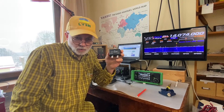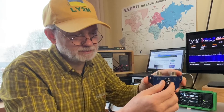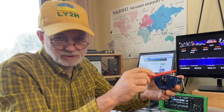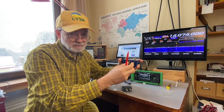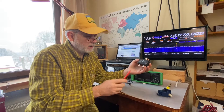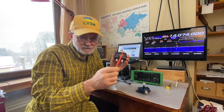So now, if it were a diplexer, it would actually work a lot like a simple antenna switch — like this good old mechanical antenna switch. Antenna A, antenna B, and the common transceiver here. You can connect an HF antenna on A, a VHF/UHF antenna on B, and you switch manually each time you change bands. But it's just a matter of time before you misbehave and transmit your HF signal into your VHF antenna. The diplexer would do exactly the same as a mechanical antenna switch, just by means of two filters installed inside.